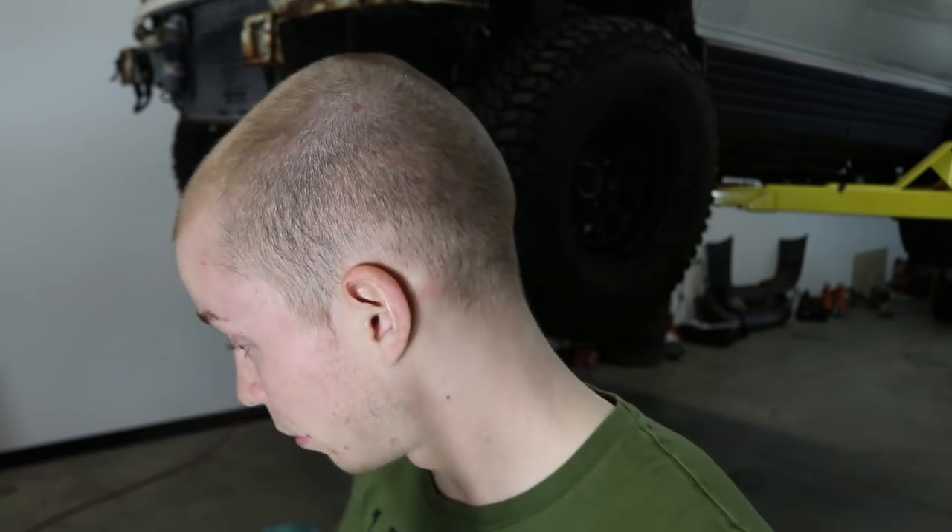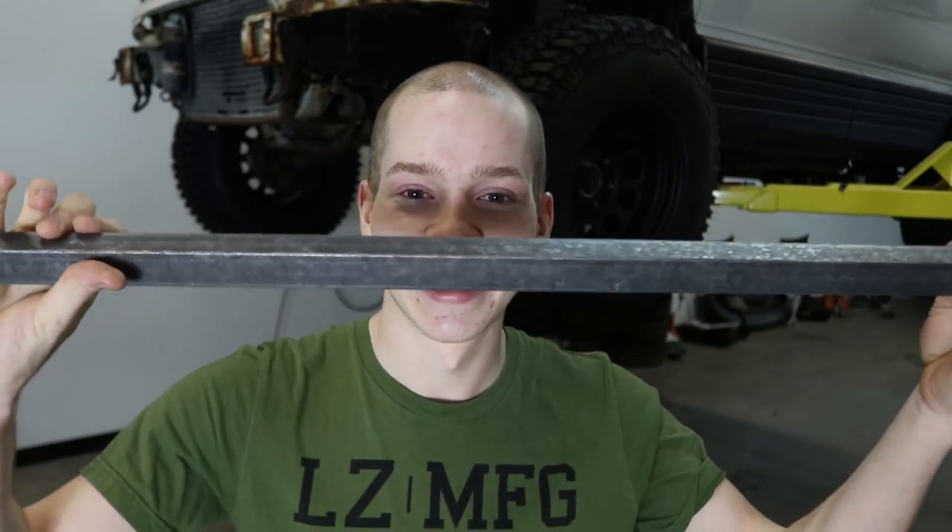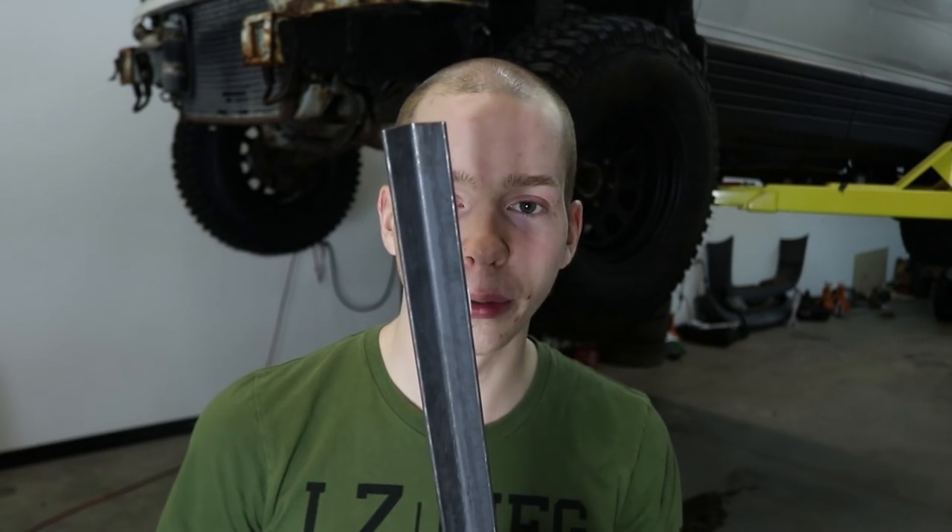More. We already installed the two-inch lift kit, but the way the van sits now, it's kind of got a weird rake and I don't like that. Plus, if we lift the front more, we can turn a little bit more — we don't have to cut as much. So we're gonna lift the front more using this — just some angle iron. We're pretty much going to turn this into a box tube and then weld it in between a couple of the coils in the spring.